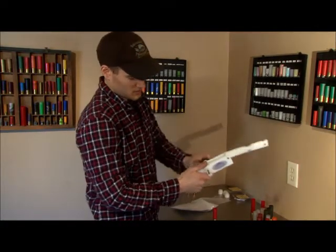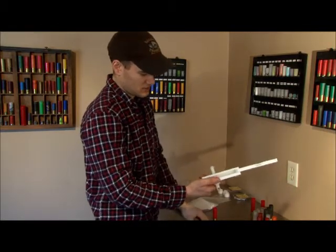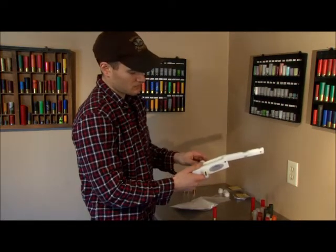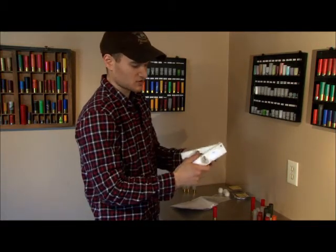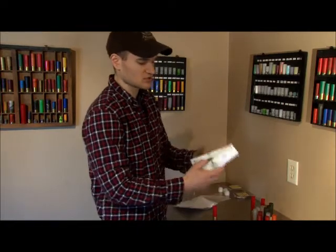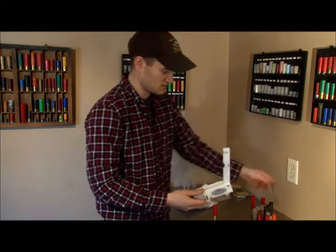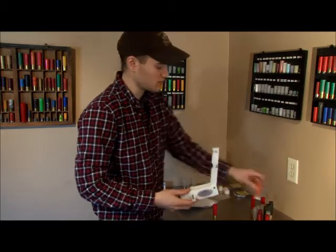And in order to take the tip out here, we're going to simply take the X-Acto Trim adapter off, and the part you cut off is going to come right out of there. You're going to assemble it and you're good to go for your next hull. And if you're using multiple hulls of the same length, just keep your washer and nut locked perfectly in place here, and you don't have to make any more adjustments. It's as simple as taking your next hull, inserting it, and going the next round.